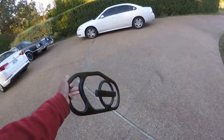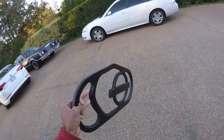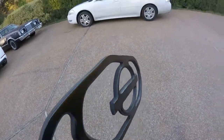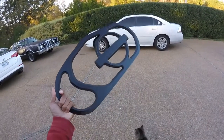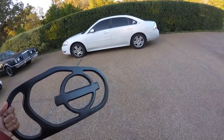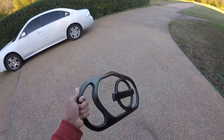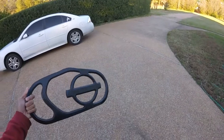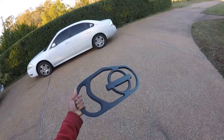Alright, so everything is sprayed this first go around. Same deal as always with this MDF - the sides are a little rough. So I'm going to wet sand this down with about 400, prime it again, wet sand it, and spray it one more time. Then it should be good to go and ready for the fleece. Let me go ahead and get this sanded down again and repaint it. Alright, 400 grit wet sand is done. It's pretty smooth, I'm going to wipe it down one more time, make sure there's no dust or dirt on here, then prime it one more time, and then it should be ready for the gloss black.